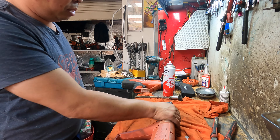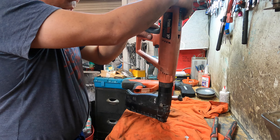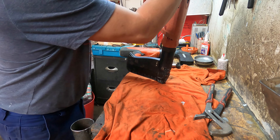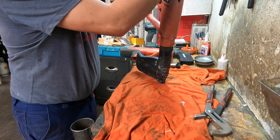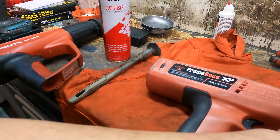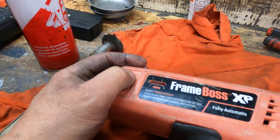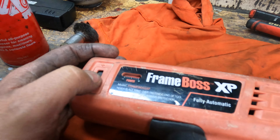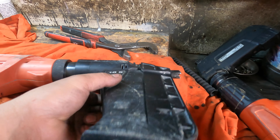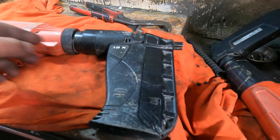When you put the nail in, you can go all the way down. Press it down and you'll hear the trigger go - very strong. That means the trigger is working. It's all mechanical - pushing down the spring, release and lock, unlock the trigger. This is the high and low power - you can turn up and down. Maximum is up, medium is lower. About 70 millimeters deep to go through concrete. That's how you test it before you put the bullet on.